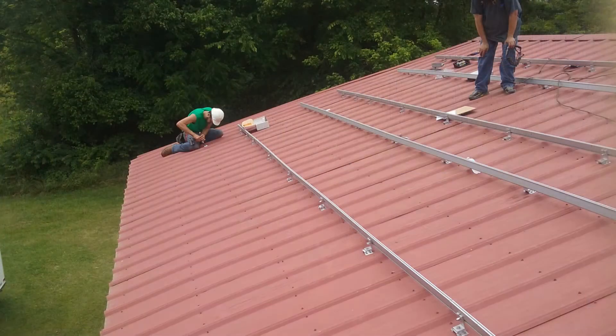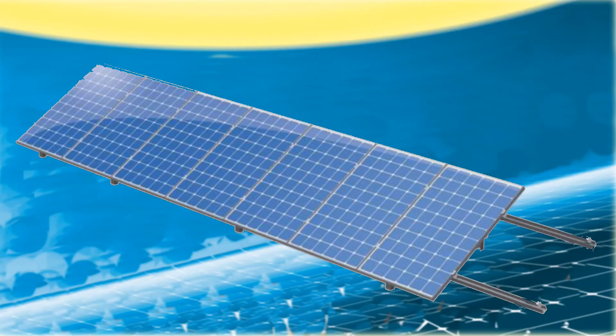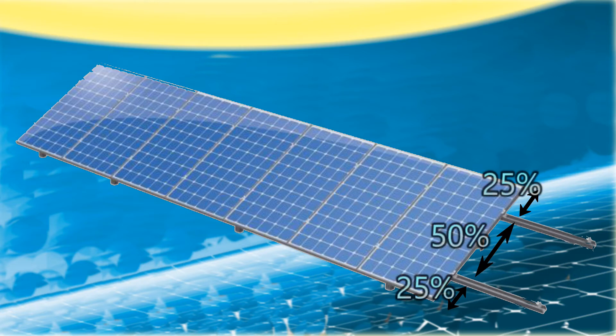After our chalk lines are marked, we need to decide where on the roof surface we want to locate our footers. We have to determine how far from the ridge and the base, and how far apart the rails are going to be. In this particular situation, we're going to be mounting these rails in a portrait configuration, which means the north-south will be the long portion of the panel — typically about six to six and a half feet long. The east-west will be the short side. The rails should bisect perpendicularly to the long side, and best practice is to come in from the top about 25%, leave about 50% of the panel supported by the rails, and overhang the bottom by about another 25%.